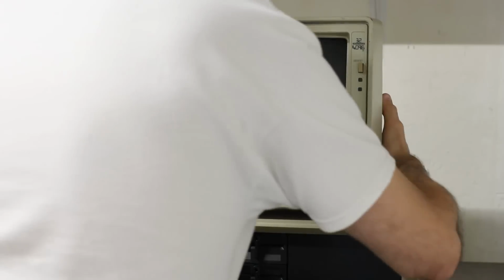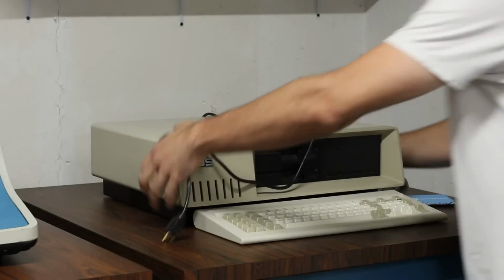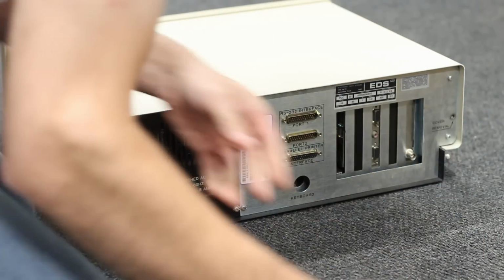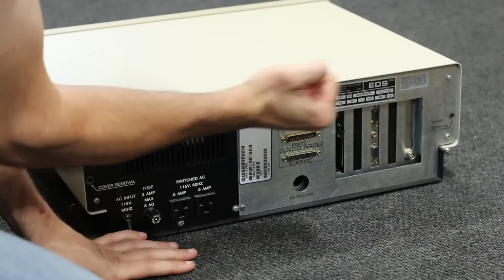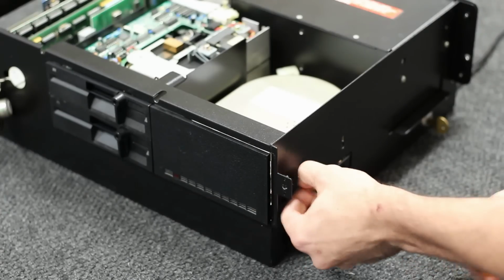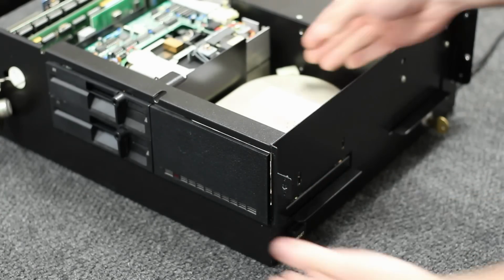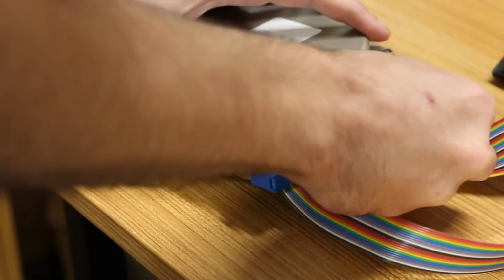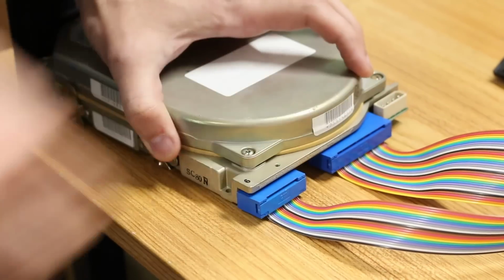Yes. So let's pull the RLL drive out of this big machine up here, plug it in, and see if we can make the Gessweinator do some interesting tricks. First things first, let's get this gorgeous little monitor out of the way. Then I'll lift the box off and get it to someplace easier to work on. To get it open, I just need to remove the 2 screws marked cover removal, and then give the cover a little love tap to slide it off the front. The ST238R hard drive is held in place with 2 screws, and with those removed, it slides right out the front. Finally, we just need to get it all plugged into the Gesswein emulator.